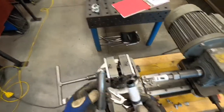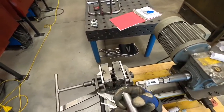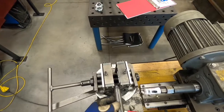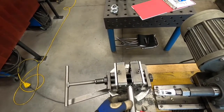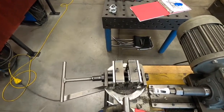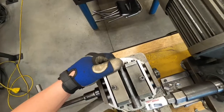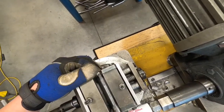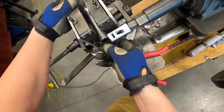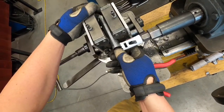To do the other side, we will just flip it over and line it up with the seams. But remember, if we're cutting it at one degree, we would actually need to rotate this upside down so that it gets the same degree angle going the same way as it did on this side. Now because we've cut a piece of that off, it may not line up in that jog where it'll grab it, but just line the edge of that hole saw bit up with our Sharpie mark. You can see the weld seam on the inside - I'm just going to make sure that's clocked all the way around to the bottom so that it's lined up with the other side.